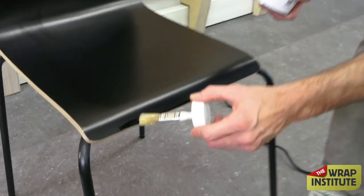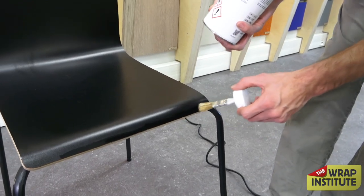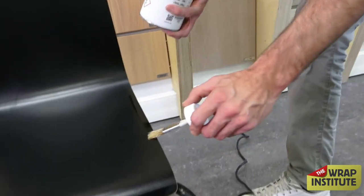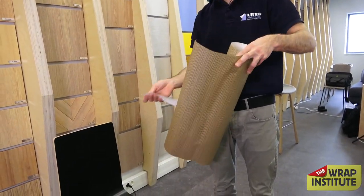It's very important to put a coat of primer on the side. In this case it's a solvent primer because the surface is sealed — the material is only going to the black, which is sealed. If this was being wrapped around to the wood on the side, you'd use a water-based primer. Know your primers.